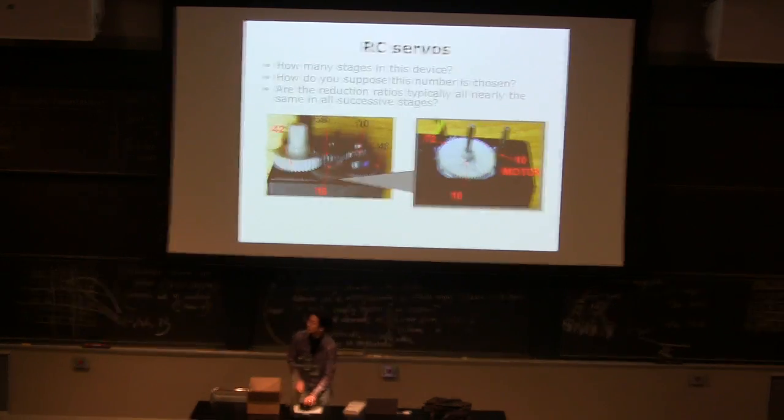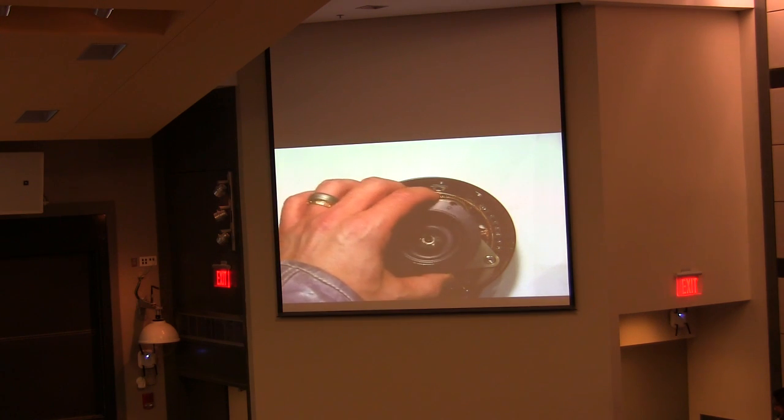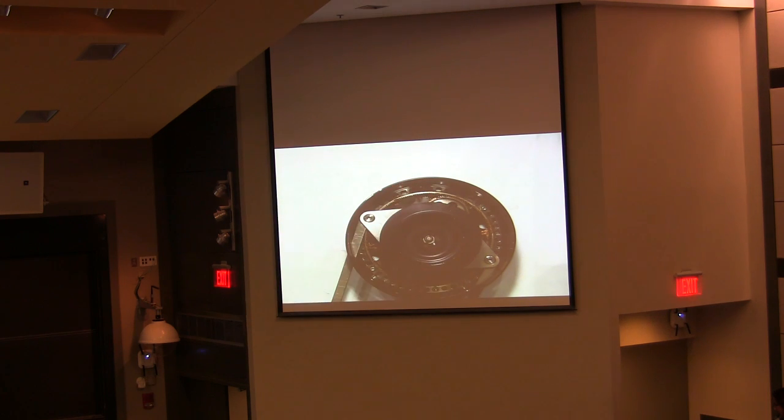This is a really good design because you can distribute forces into 4 points, and then separation forces are all canceled out. Right? The separation force between the sun and this one will be along the vertical string, where all 4 forces are canceled out. So there's no net force in this case. Otherwise, this shaft would be separating or locked, and then your structure would have to handle it. In this case, they all even out, and this one piece can handle this. So it's a really good design.